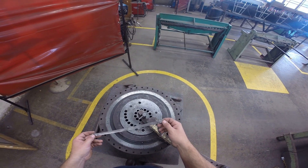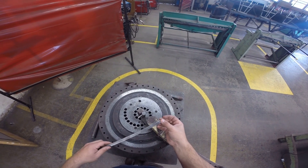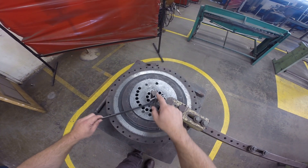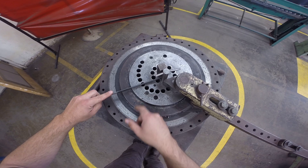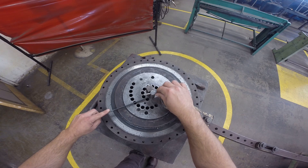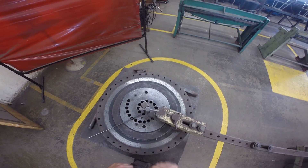To make the first bend, which is going to be the foot of the dustpan handle that attaches to the dustpan, I'm going to take my 1-inch mark. I'm going to use a squared center, place it in where my 1-inch mark is right on the edge of the square using the locking cam, turn it clockwise — locks it in.